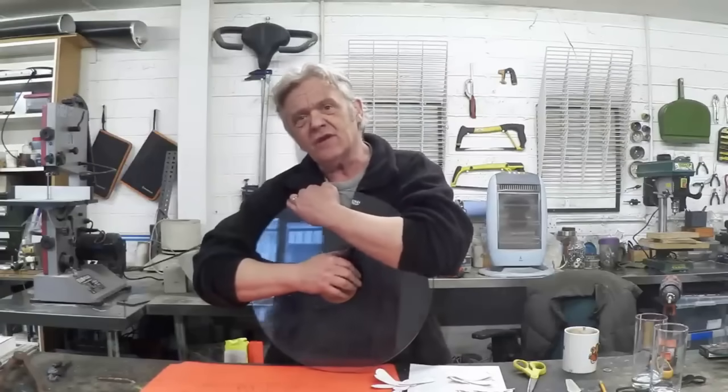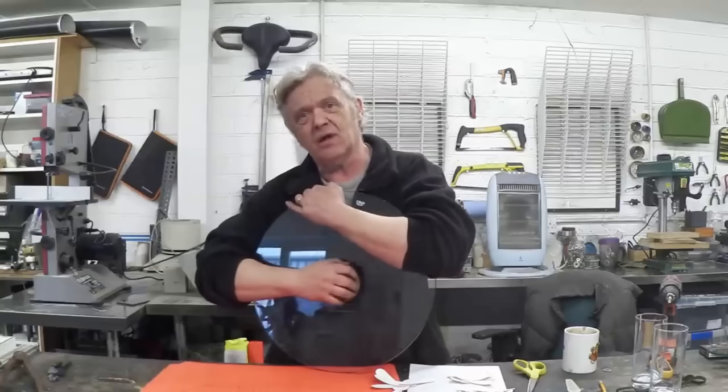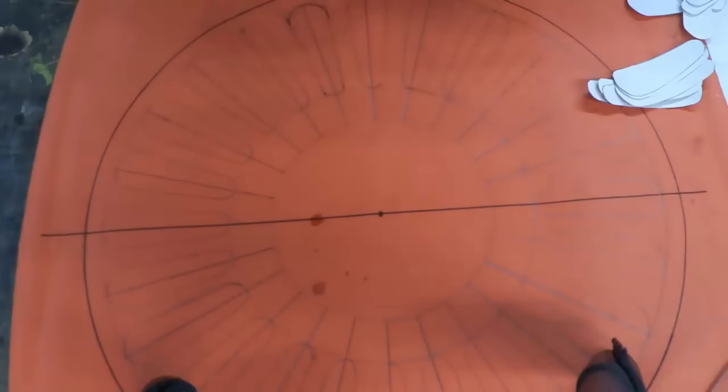Sector sizes — you need to leave a gap between the sectors. Here's my circle, the same size as those discs, divided into 24 sectors at 15 degrees apart. That gap between the petals needs to be more than a centimetre on a disc this size, and the average thickness of the sector should roughly match that gap. The corners are rounded — I put a washer on there and drew around it where it hit the edges. I created a little card template, went around the whole ring marking positions, and also used that card template on my metal foil.